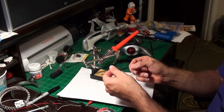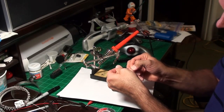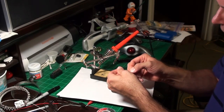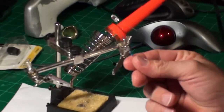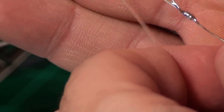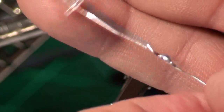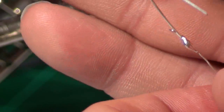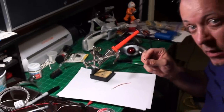How do I know I got a good solder joint? I start tugging on it — that's going nowhere; I'm afraid I'll start breaking things if I keep tugging. Another way to tell: see how shiny it is? Shiny solder joints mean the heat was applied properly — I heated it first, then applied the solder. If you apply solder while it's cold, you'll get dull solder and it won't be strong.